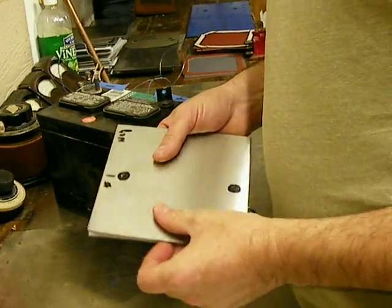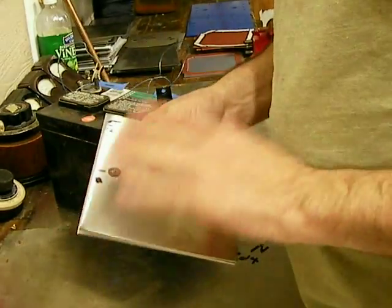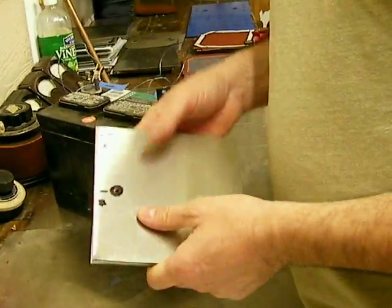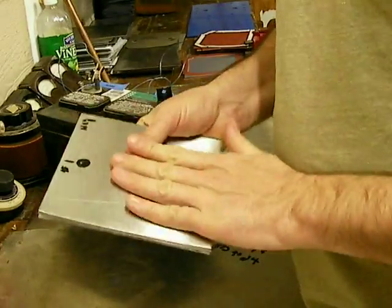The first thing you want to do is drill the plates, make all your cuts, and do all your prep work first — sand the plates, dip in muriatic acid, whatever you've got to do. I do everything up to this point because I set up my plates so the two outside ones go against the gasket on the outer plates.